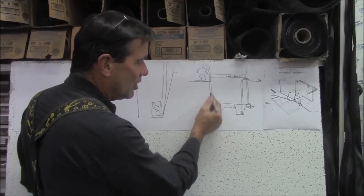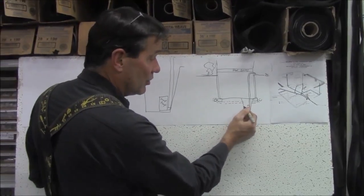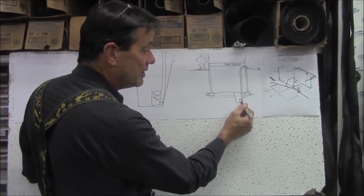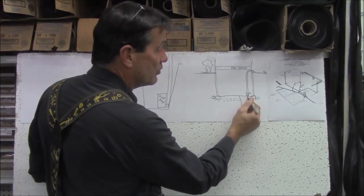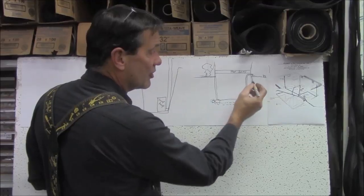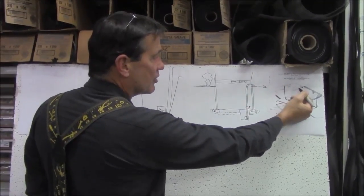Hi, I'm Blair Gilbert, here for Gilbert's Pro Hardware in St. Clair Shores, Michigan and MrHardware.com, to do a little dissertation about sump pumps. They usually last four to eight years. Water comes down the wall, accumulates, goes to a sump pit. Water accumulates in there, gets higher, pump kicks on — there's a check valve in here that only lets water go one way — and the water pumps out on the yard, hopefully discharged six to ten feet away from the house.